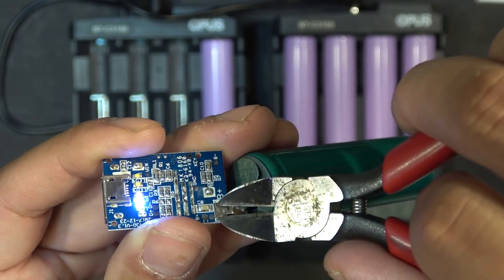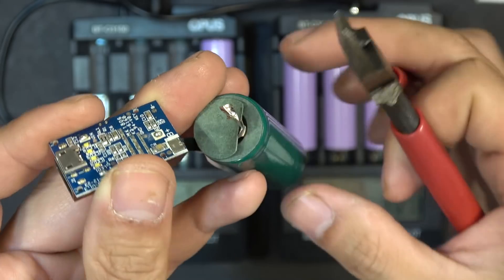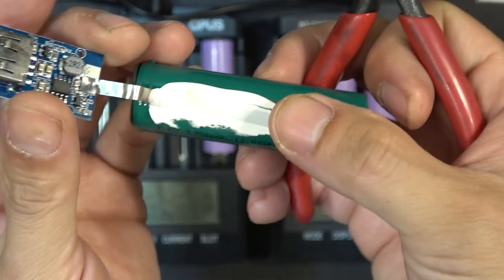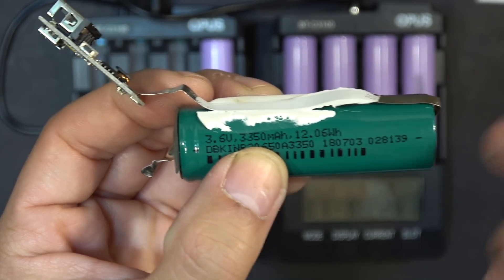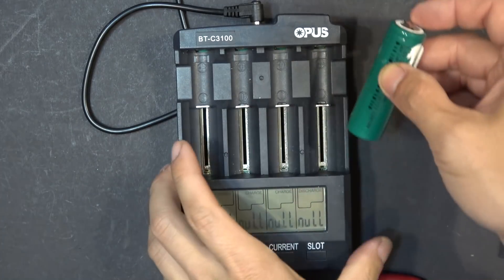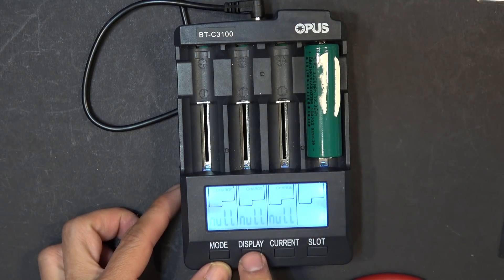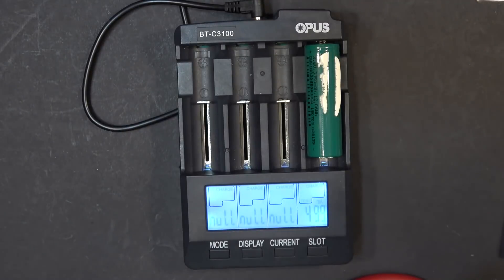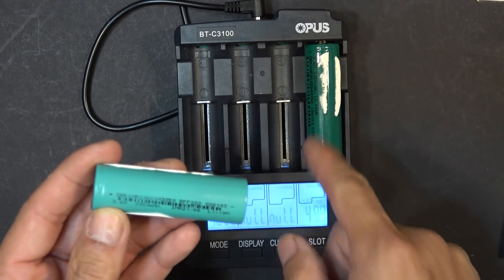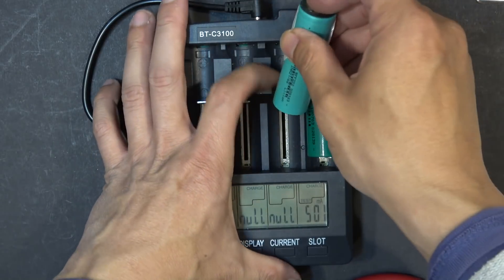My next step is to remove this. The light turns off. I'm going to test the capacity on my charger to see if it's actually 3350mAh as claimed on the cell and on the packaging. Now let's put it on the charger — 3.79V — so I'm going to charge it first. I also have another 3350mAh cell from another USB power bank, not this one, but the same Chinese-made USB power bank. This looks pretty much similar, except for the plastic wrapping. I'm going to test this one also.